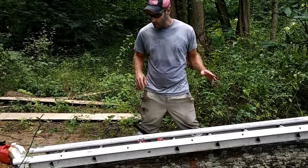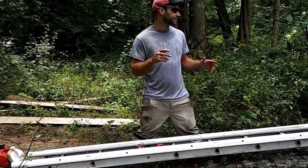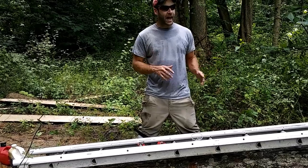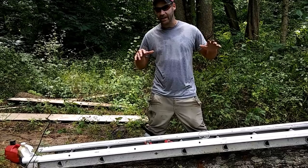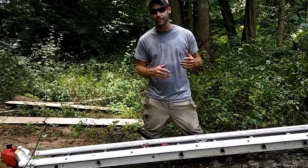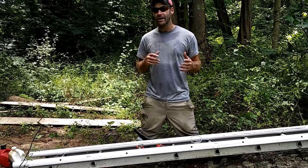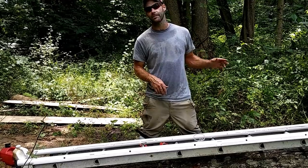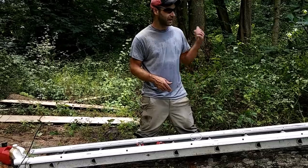Another thing is with the trees, if you use a tree that is in a hedgerow or in your yard, it's not going to be the greatest wood. When you try to dry it, it's not going to work out very well for you because the rings and just the whole entire equilibrium of that tree is not straight because it was in an open area. So you want to try to find something in the woods if you're going to be milling lumber, not to mention who knows what's going to be in that tree. Because you're doing all those cuts, the probability of hitting something just skyrockets.